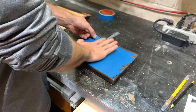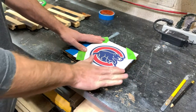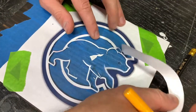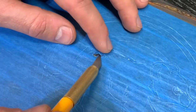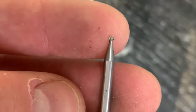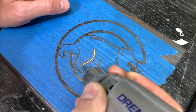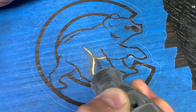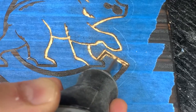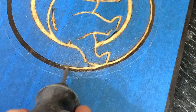The next step was to carve out the logo. I laid down some tape and then secured a piece of paper with the logo on it. I used delicate surface painter's tape to avoid pulling off too much of the charred wood. I then used an art knife to score around the intricate design and really took my time here because this will serve as a template for the next step, which is carving away the actual logo. For most of the carving I used a Dremel with a 106 bit, which allows me to get most of the fine details but also lets me take away larger patches of material when needed. I took really light passes which keeps the bit from catching and I slowly worked around the entire logo. I did this part now instead of after everything is glued up because if I messed up, I'd be able to replace the piece more easily.